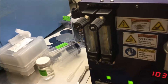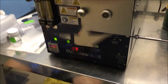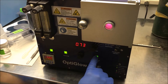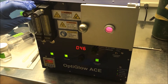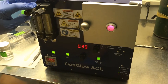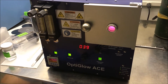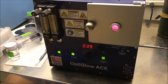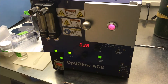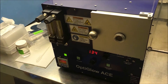We're going to run this at about 100 watts. The system will pump down and we're bringing the nitrogen gas through the left flow meter. The system is pumped down, we hit the start button, and you can see the plasma ignites. The pressure equalizes up to about 0.4 torr, and we're going to run this for about 30 seconds.